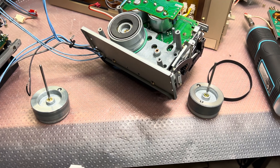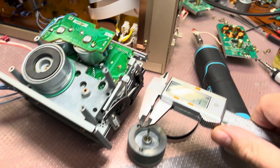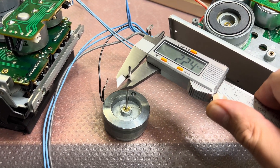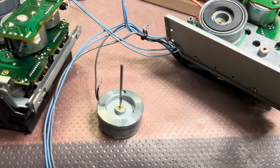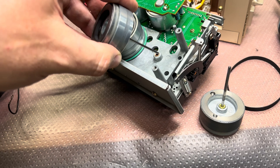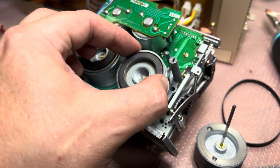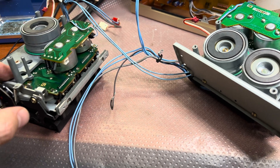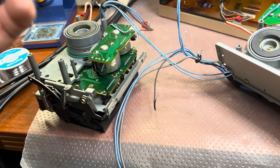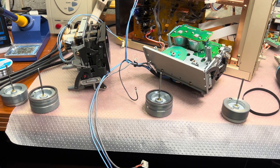We're having more and more surprises. The original shaft measures 2.44mm and on the 555 the shaft is 2.24mm. This means the shaft is very loose — I can feel it when I put it in, see how much it wobbles. This means we will have to replace the base with FG coil, both the capstan and the drive board, just to see how it performs.